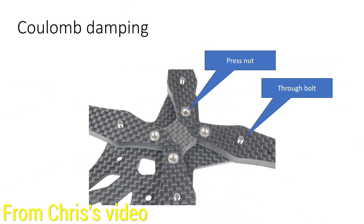The Apex frame arms have a very unique mounting mechanism. There are two bolts per arm, but the center set of bolts don't travel through the top plate. The outer set of bolts travel through the bottom plate, through the arm, and through the top plate to bolt together very strong and tight. But the center set of bolts travel through the bottom plate, through the arm, and into a press nut that's inside the arm — not in the top plate.